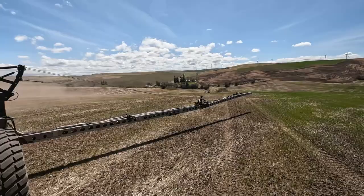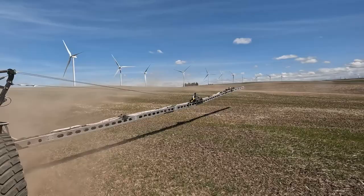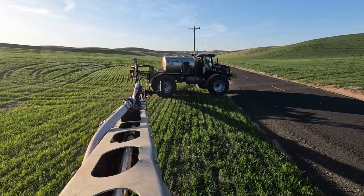My Vector here has 72 individually controlled valves, one for each nozzle. These valves pulse open and closed automatically based on the ground speed and the estimated speed of the booms. While turning, the outside boom has to increase its rate, or pulses per second, in order to keep the correct rates.